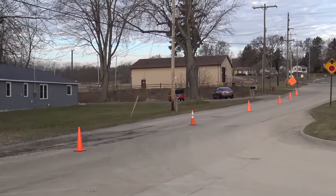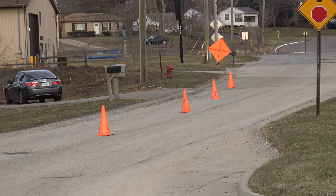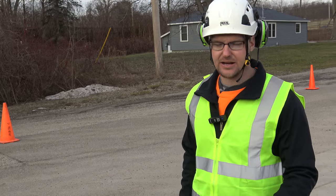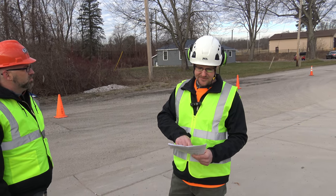And then how far down, where do we usually put the tree work ahead sign? What's a rule of thumb? Well, whatever's common sense. Sometimes you don't have enough room. For instance, on a 35 mile an hour road like we have here, the buffer length will be 83 feet.